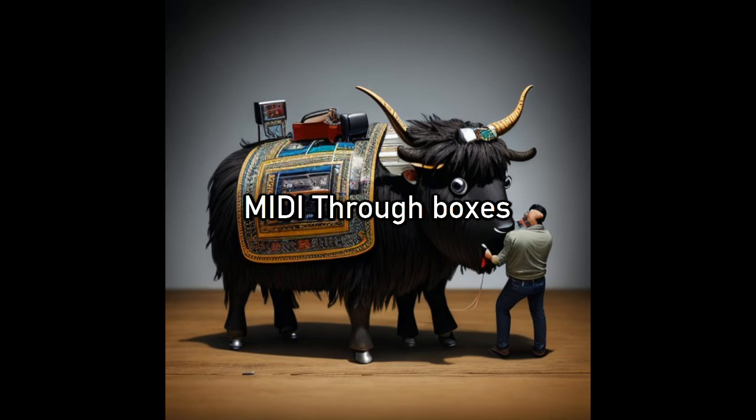Because I thought I could maybe fix that ground loop by putting a MIDI device in between the audio input and the MIDI out. That introduces the optical isolation that is needed and gets rid of the ground hum, but it could also add its own delays and instabilities to the signal and so on. So I investigated that option. And the simplest MIDI through port can be just optical insulation of the signal and then sending out exact copies of that signal on the output via a buffer.